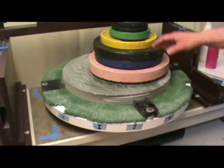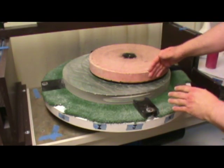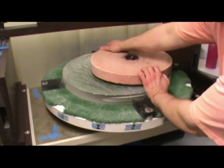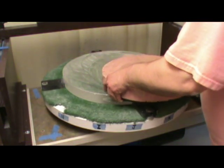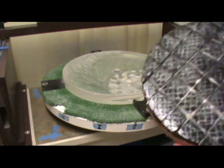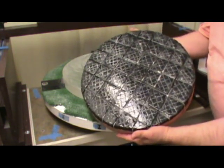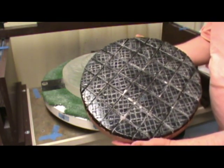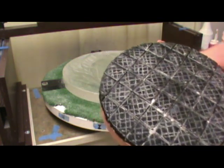We're done pressing now. If you've done a good job with the cold press, this should be hard to get off — it should stick quite a little bit. Popped loose. And there's a look at our pitch lap. It's a 15-incher with nearly half an inch of pitch on it. It's been channeled in a previous video, and I'm going to prop it up now and get it ready to go.